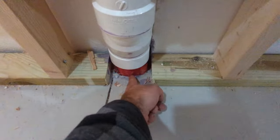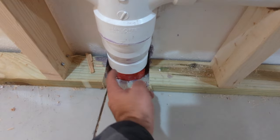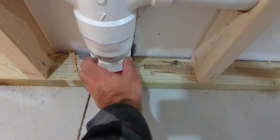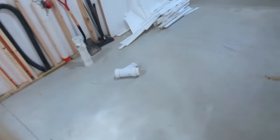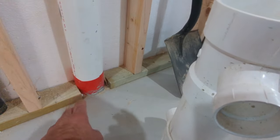To start with, we had the ceiling tape here that isn't going to glue well, so I was able to see that I had indeed cut that back to expose what's going to glue up into this fitting and not really disturb where it gets tight at the wall. We'll do the same thing here. I'll set this first fitting down to about flush with the plate, leaving an inch and a half exposed. I'll cut the tape back to that point, and from there we'll go uphill.